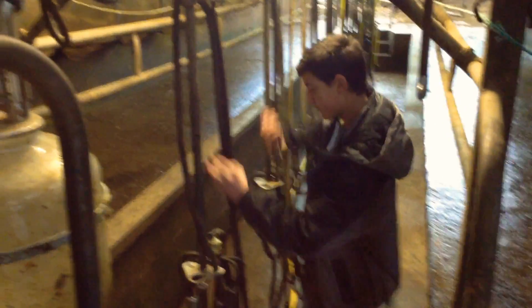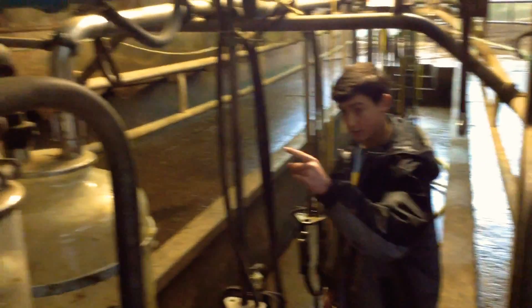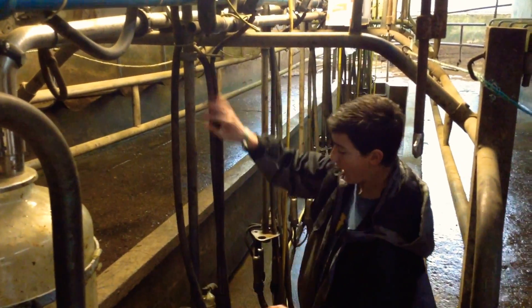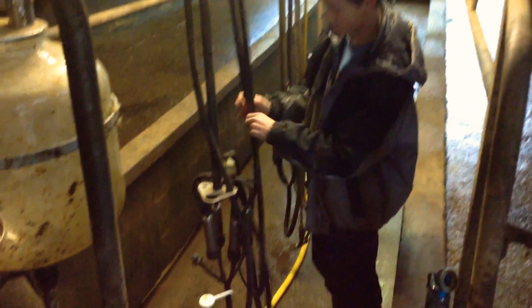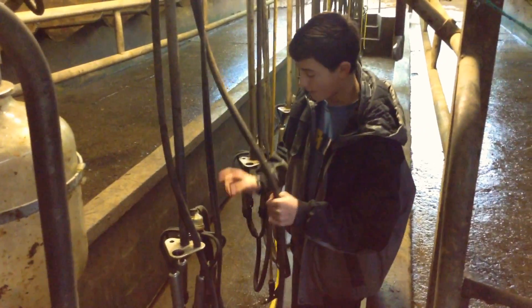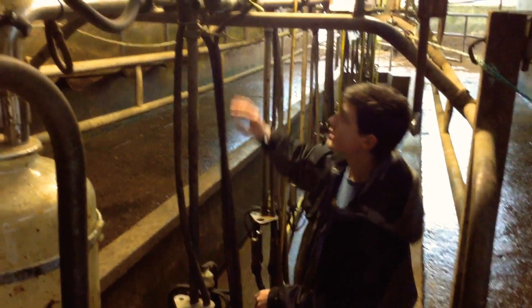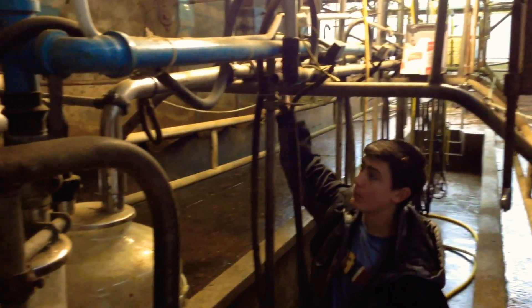It is this pulsator, this cluster, and a vacuum pump, which is out the back. The pulse, which is provided by this pulsator, would go down through and come in there through this pipe here. And then this pipe here brings the milk out, goes out the other end, and then it comes up, around, and then into this metal pipe here.